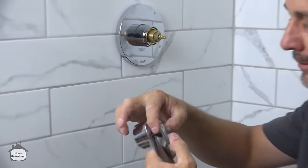And this is why you need a laser, because you don't want to install your bar like that. And yes, you could be that crooked. So what we're gonna do is visually set this so that we like where it sits. We want it to be not on a grout line, because that's too much of a chance of it chipping and causing a weak spot where it'll crack. And I like this, about 1/2 inch from a grout line. That's good for me. So I'm gonna put my pencil mark there. I'm gonna translate that spot there.